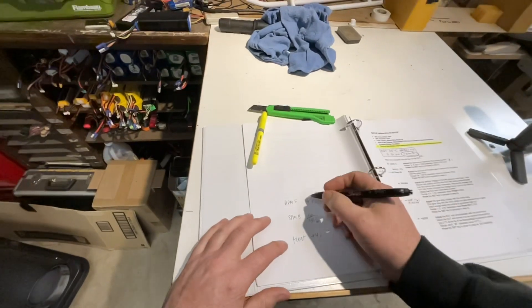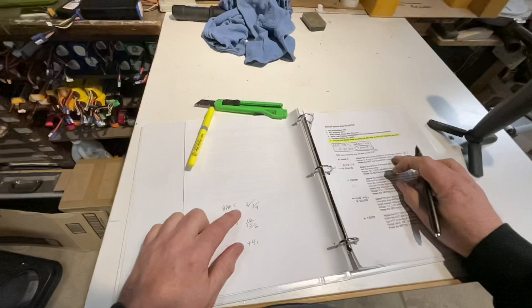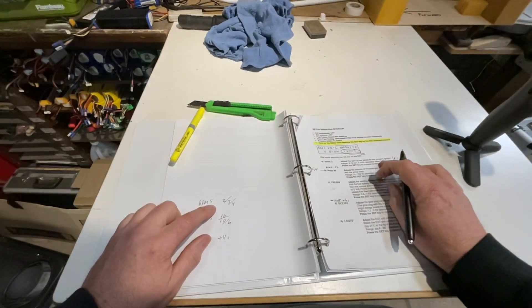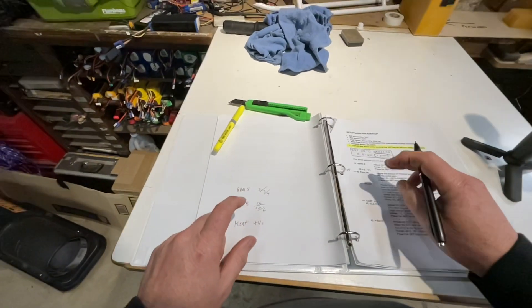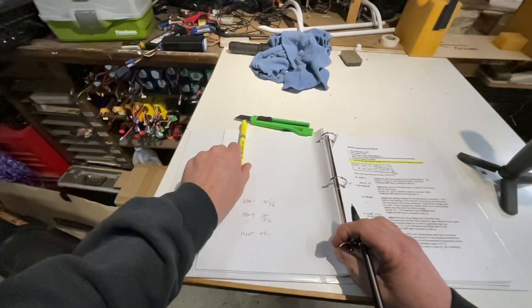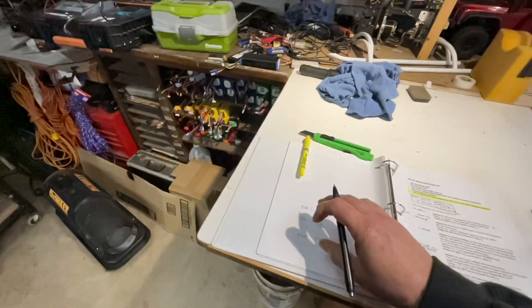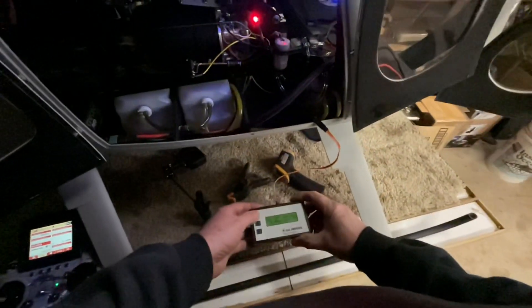This time I've upped the RPMS to 4, which would be 4,000 RPM — maybe get a little more air flowing in there. I didn't check the exhaust gas temperature maximum on the previous runs, but this one hit 708°C, so that was a little too hot. Turn on the switch and push Set. Flight RPM — let's see what this does.